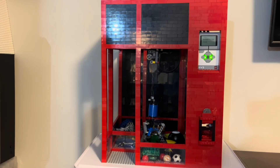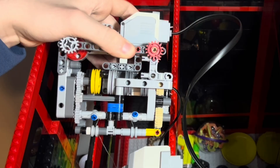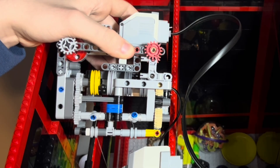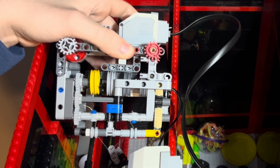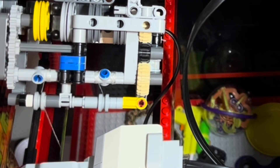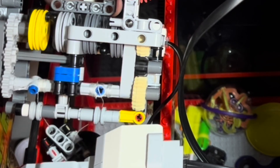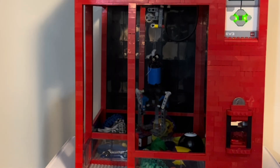Back at the claw machine, I unfortunately did not win this time, but let's take a quick look at how those spools go the other way so that way it can pick up and close. It basically just does everything in reverse. That smaller gear there has a friction pin, so that way that second spool can't spin freely — it has to wait until it gets spun.